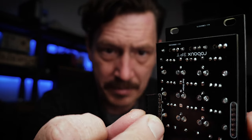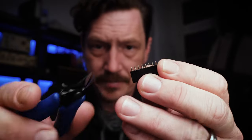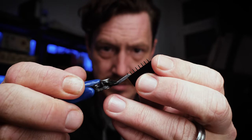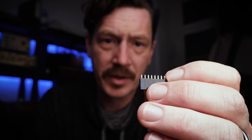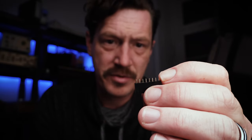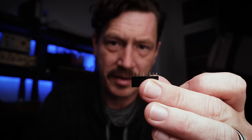So what I'm thinking that I need to do is either just try to, can I get this to focus again? Yeah. I either just need to try to snip a pin off of there, or maybe I can try to pull it out. I'm gonna try pulling it before I snip it. Those pins shouldn't be contacting. I don't think there's anything going between pin to pin that I would mess up by trying to pull it out. I think it's just a plastic enclosure.